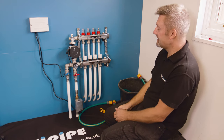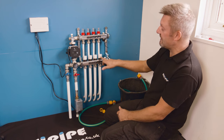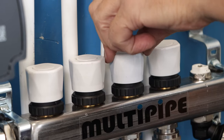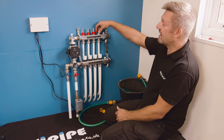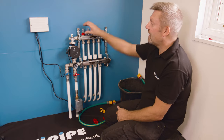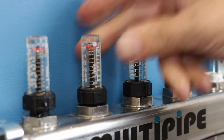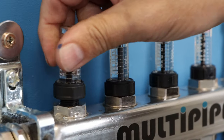In preparation, we're going to open up these little actuator points. Normally electrical actuators would live on here to control the flow of water to different zones, but in this case they're not fitted, so we're going to open up each individual port completely. I'm just going to pull off the caps off the flow meters and close all the flow meters apart from the first one on the far end of the manifold, which we're going to open fully.